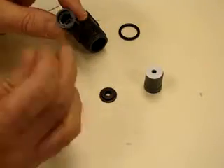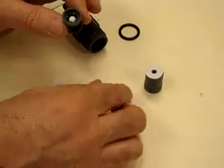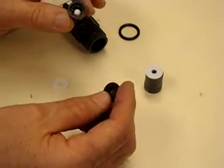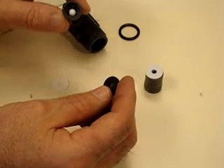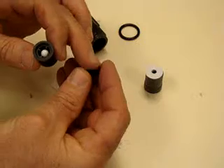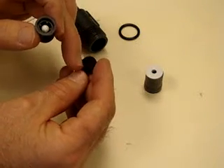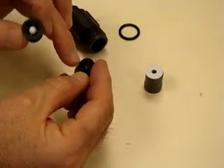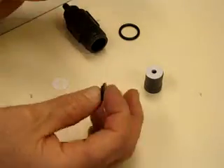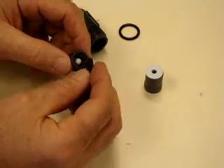What you want to do is clean the ball — rinse any debris out of the housing and rinse everything off the ball. This is where the problem usually is on a pump that's not pumping: if you've tried to bleed the pump and it's not working, it's usually the ball seat. Check to make sure the seat is fine. If you see deterioration around the hole, or when you wipe it you get some black residue off, it means it has started to deteriorate and you'll have to replace the whole assembly. Otherwise, all you'll need to do is clean it.